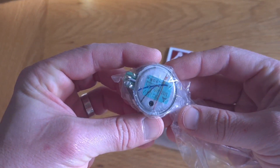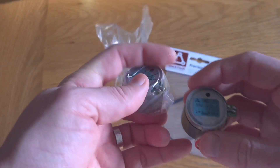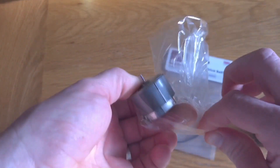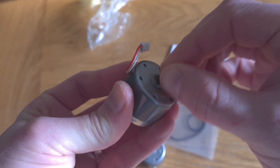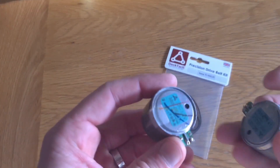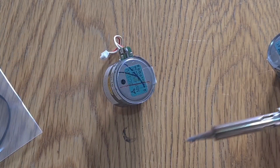If the bush on the top is worn, then the one inside the motor which you can't get to is also worn, so there's really no other choice here other than replacement. I've cleaned out all the rubbish and gunk and IPA'd it, but it is what it is. We've got a nice belt kit and a new old stock motor that is absolutely brand new. It matches up perfectly - there are two terminals on it that are soldered, so you need to desolder a little bit off the new one and then swap the wires over identically, otherwise all your tapes play in reverse, which isn't usually very useful. The wobbly one compared to this one has absolutely zero play whatsoever - it's a good swap.